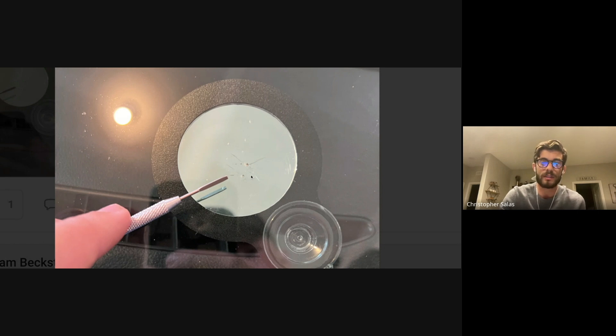You're not going to make it disappear completely. At the end of the day these cracks are still there. When we fill them in, the crack is still there — we can't make it completely vanish, but it should look a lot less noticeable. When you look at it at different angles and it looks more noticeable at one angle than another, that is normal. Even with a completely filled crack, it's normal to see the scar it leaves. But if there is air in there, it makes the crack and scar more prominent.